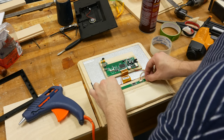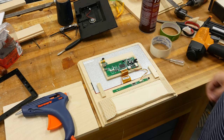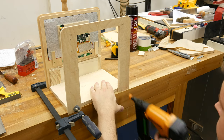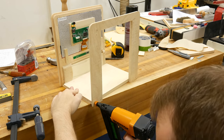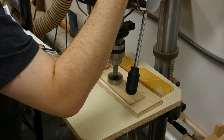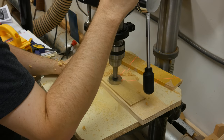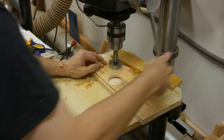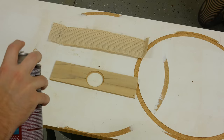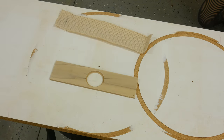This little piece here is the touch panel, which is required because it has the cables for the TV to work, so I just used some hot glue to keep that down as well. With the majority of the components in place temporarily, I went ahead and used some brad nails to put the cabinet case together. I had to take the cloth back off the front panel because I forgot I had to put a speaker in it. I used a two inch, then one and three-quarter inch Forstner bit to put the hole in so the speaker can sit inside. This is a little two inch speaker I got out of a set of computer speakers. I sprayed more Super 77 and redid the process, this time including the speaker.